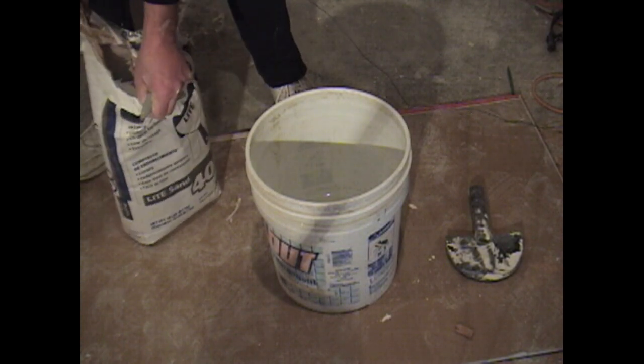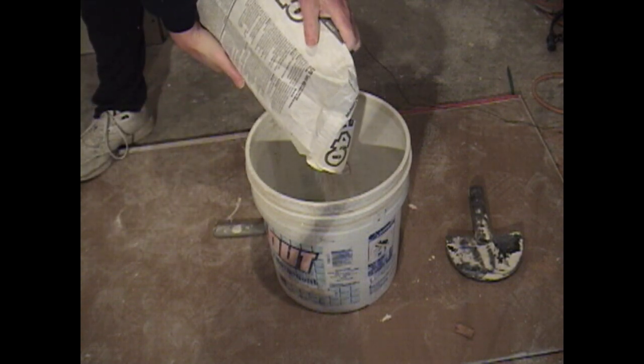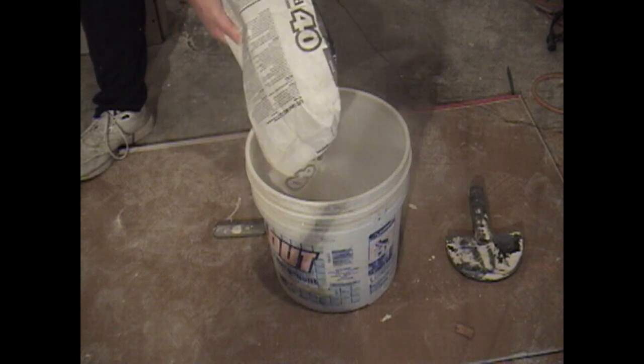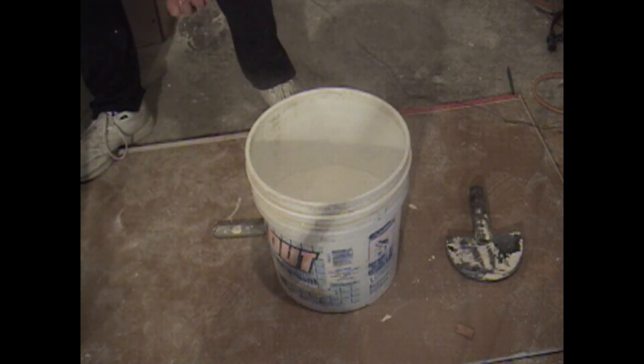The residual amounts of old hot mud mixed into your new hot mud can cause your fresh hot mud to set up unevenly — it can lump up, clump up, or just fire completely sooner than you anticipate.